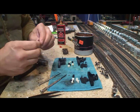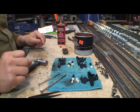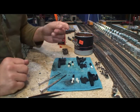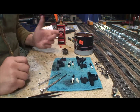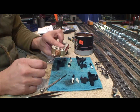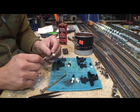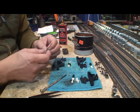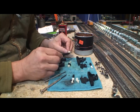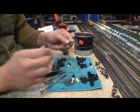This SD40 is also missing the drive shafts — probably not lost, I just don't know where they are — so this is a good chance for a demonstration. We're going to make drive shafts out of plastic pipe and piano wire. You can buy them, but since I already have the materials on hand there's no reason to. This is a good chance to show that you don't need to invest tons of resources into a fix like this. Think like an old-school woodworker: if you don't have it, make it. Learning to make some of these parts yourself changes how you look at projects.